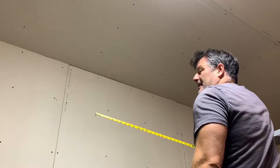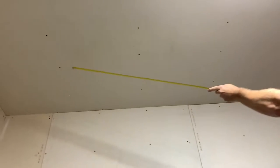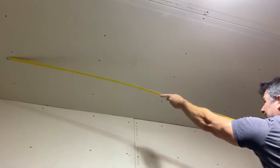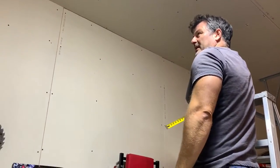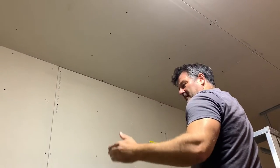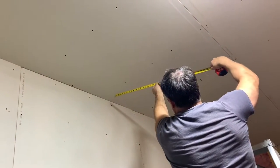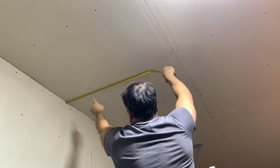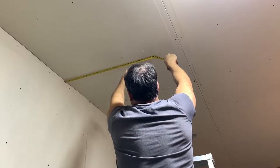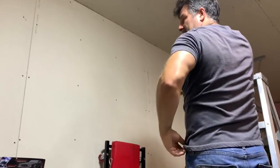You're also confined by the spacing of your ceiling joists. In our case we're picking mounting spots roughly 75 inches apart, which is not quite the optimal two-thirds, but if anything this tightens the straps on the kayak, pulling them a little closer to center on each side, which should actually help stabilize it. To keep our pulleys consistent we're also measuring off a wall as a common reference point. Our kayak is roughly 29 inches wide, so we'll center ourselves at the two-foot mark on the sheet.